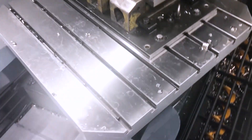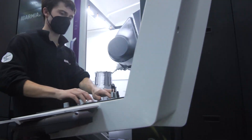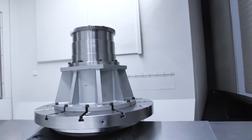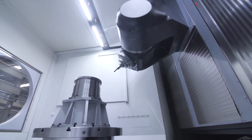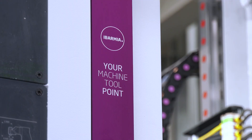On the Multiprocess, you can load something like two to three tons on the table. We have a direct-drive torque motor table that can load up to 2.2 tons on the standard, and up to three tons for turning, with a turning table that goes up to 500 RPM. Meanwhile, the Xtreme model can go up to six tons on milling operations.